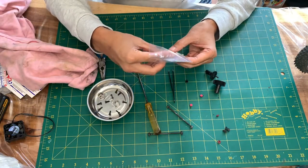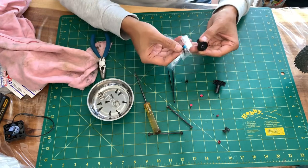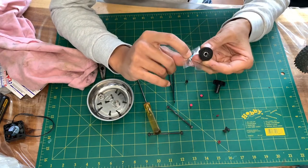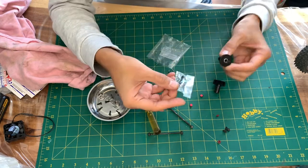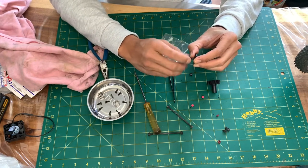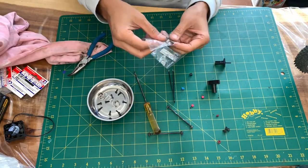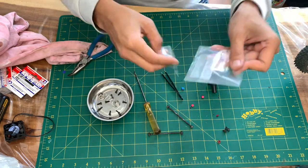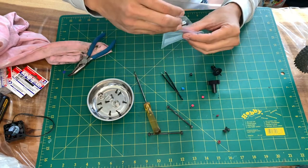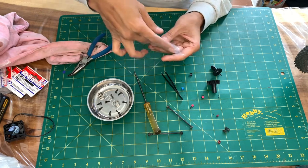Okay, so it looks like everything is exactly the same part. So the only difference is they've got some Loctite put on there. So I'm gonna go ahead and use only the nut and some Loctite. I'm gonna leave the rest as spare parts. Yeah, that's the correct thread. So I'm gonna get some blue Loctite out. That way I don't have to rebuild all the thrust bearings and the screws and whatever, because it does come with thrust bearing balls. Assuming you're making a new one, I don't need to. This is still brand new. There's no need for that. So I'll save this as spare parts.